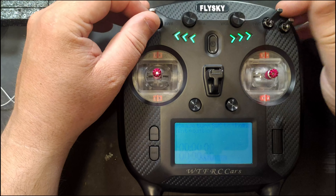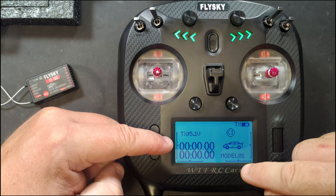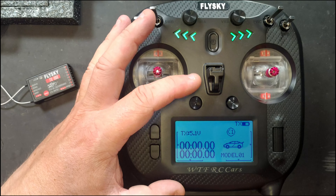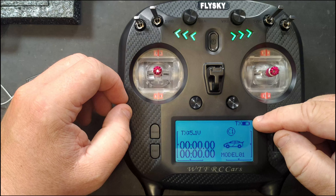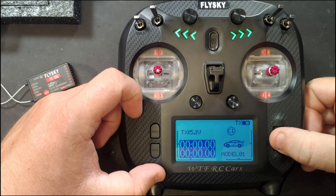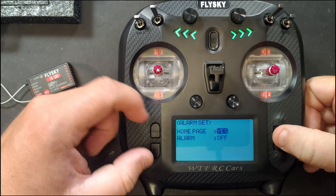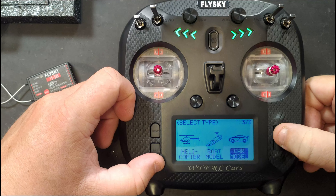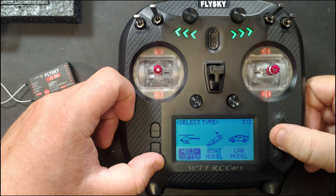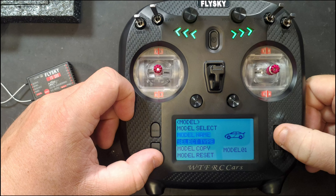The power button will warn you if any switches aren't in the home position, so your RC doesn't shoot off and do something unexpected. On the main screen you have four little trim settings that depend on where your trim is set — it will beep to tell you it's centered. You've got transmitter battery level and voltage, quick access to timers, and quick access to sensors where you can choose what's shown on the home page and set an alarm. There's also quick access to model type — delta wing, fixed wing, multi-axis, excavator, robot, glider, heli, boat, and car. We'll leave it on car.